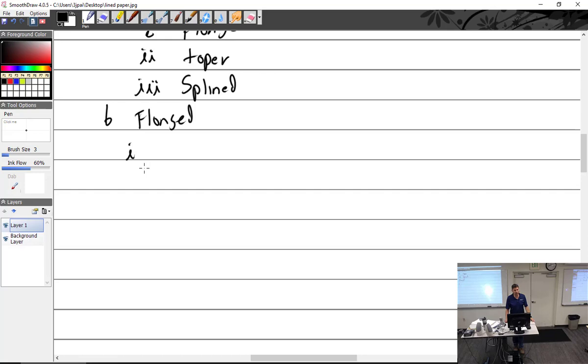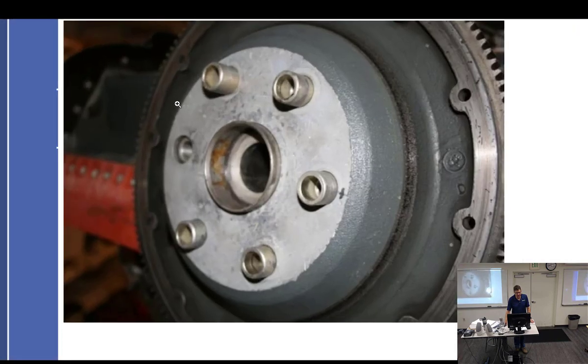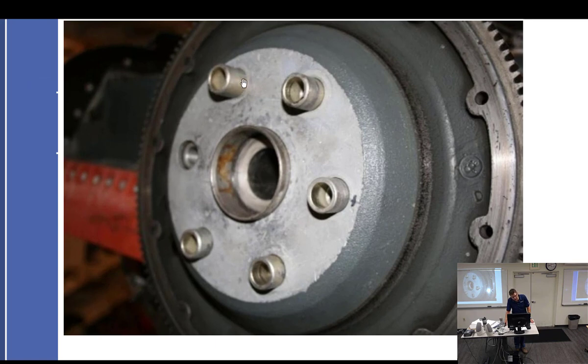In theory, you should be able to look at not only the starter ring gear support that has the little O on it, because look at this right here. See how that one's not sticking out? Somebody screwed up, and that's what happened here. But there should be one of these bushings that is different from the others. It's probably that one right there. One is smaller than all the other ones. It's got the little shoulder on it right there, so it's smaller here, and then it gets bigger right there. Kind of hard to tell. And this should usually only fit on one way too.